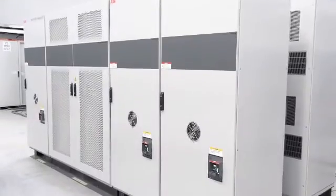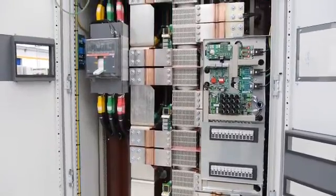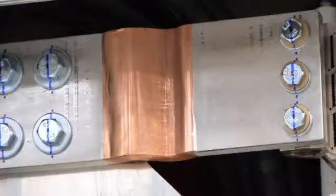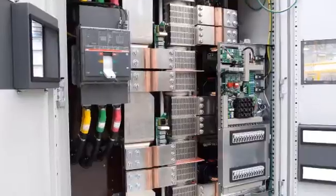The system is made up of four principal components. The utility disconnect is a low-loss, ultra-robust SCR thyristor switch. This component supports the load current and can commutate off in less than two milliseconds.